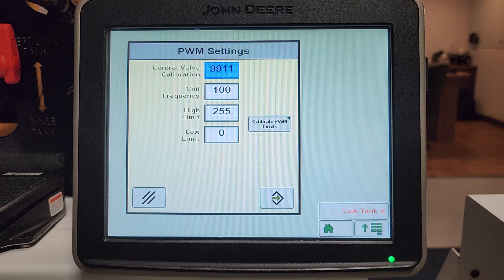Once you lower those two digits, your pump should take longer to get to your target rate, meaning you're slowing down the pump's response rate. If your pump is too slow to get to target rate, you could raise that number — say if it's 4012, you could take it to 5012.